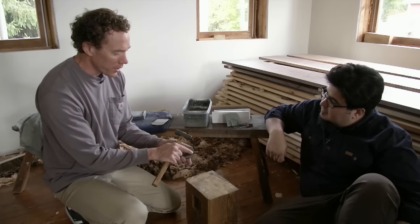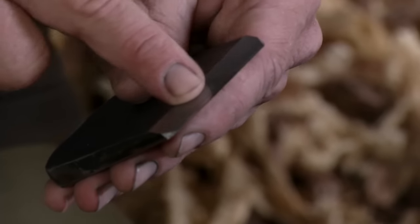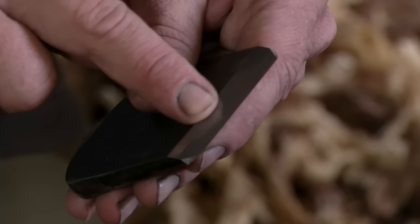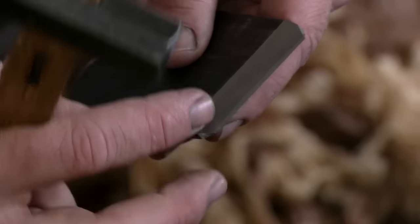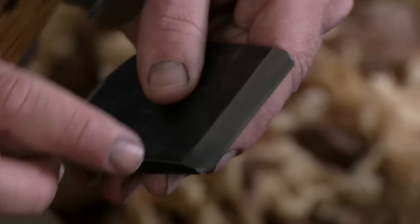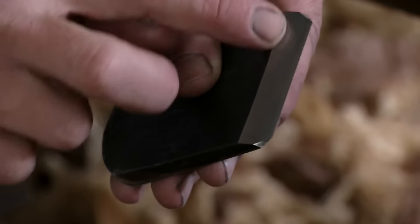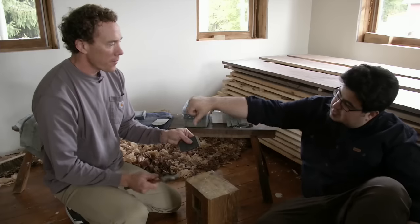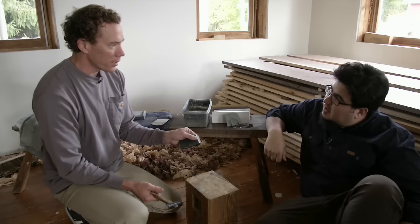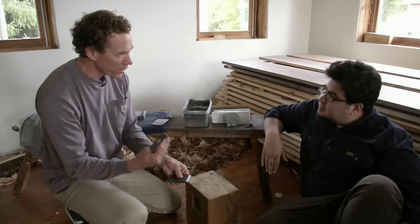Right now we need a little bit more flat right at the middle. I'm going to be hitting the blade on the soft steel. If you break it into thirds, the bottom third is the hard steel, the middle is starting to get risky, and the top third is much safer — there's just more of a cushion of soft steel. So towards the top of the blade, further away from the hard steel, is less scary. You can start there and work your way closer to the hard steel as you get more confidence.